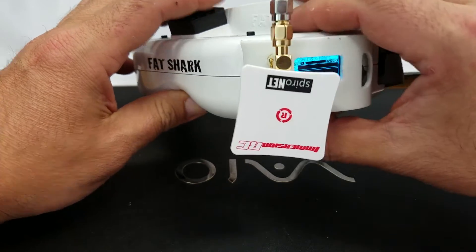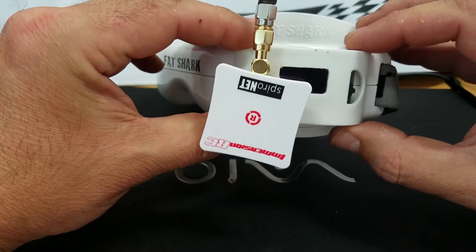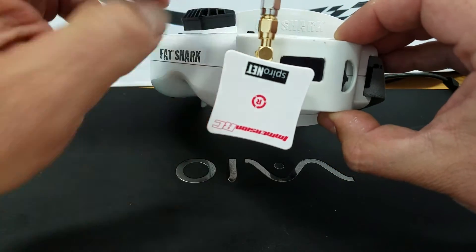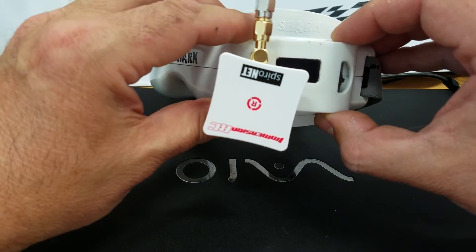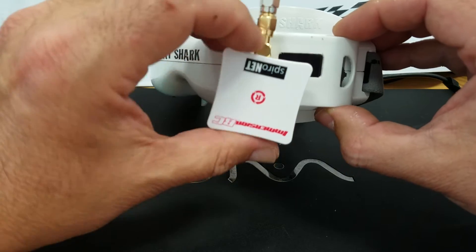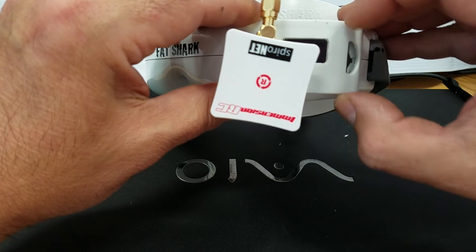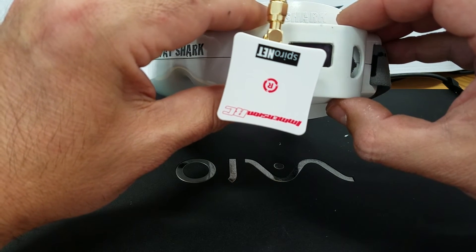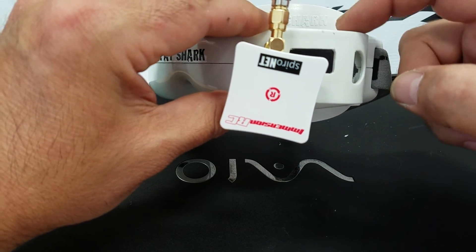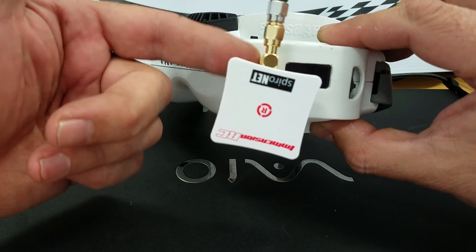When you take this off once you're done using it, if you want to put it back in the case, just grab it from both sides when you pull it off the unit. I would remove your antennas first — otherwise you put undue pressure on the antenna mounts themselves. Once those antennas are off, grab it by both sides, pull directly straight back towards you. It comes off really easy. You just want to do that so you're not grabbing onto the wheel and bending your pins connected to the Fat Shark, and you don't want to put any hard pressure on the antenna mounts either.